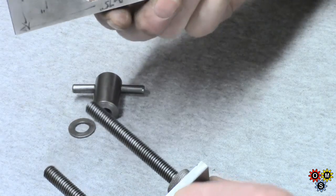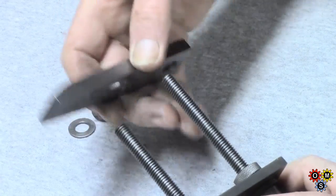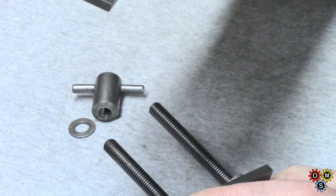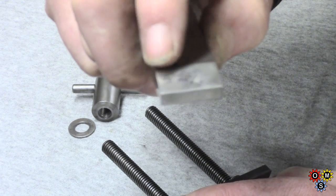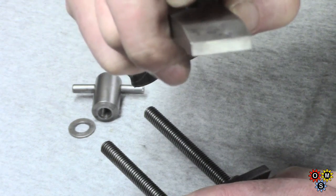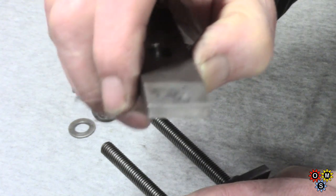and we can put the top jaw on. So when that goes on, again, forgetting whether I mentioned I'm doing this in 2 bits, that's also draw filed finish. There's about 5/8 there. It's nominal 15 degrees. Again, up to what anybody wants to do.